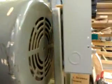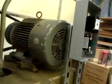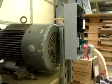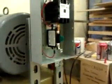And then I also got the magnetic starter today. Mounted it, got some channel struts here, just bolted it to the tank, then to the back. And there's about an inch between the motor and the compressor. I hope that's enough. The only part that sucks about mounting it there is if that motor ever burns out. Most of the newer ones now are a little bit narrower but longer. So I might have to relocate the contactor or the magnetic starter again.